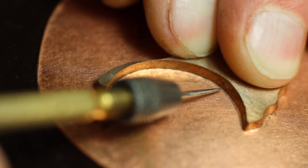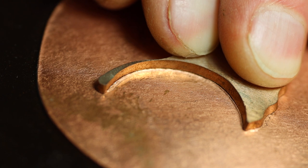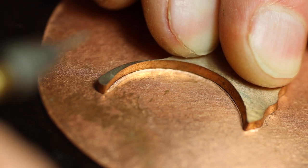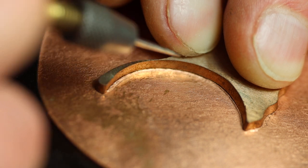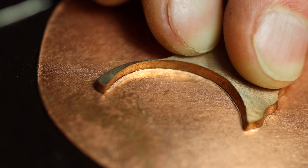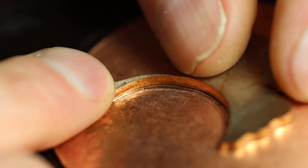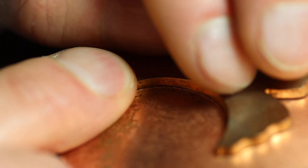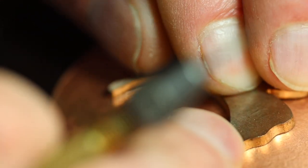Don't put yourself under so much pressure. Feel free to engrave your line a little further away from the scribe line so you've got more of a lip to push up. You can always push it down later and chisel away any excess if you need to — we'll cover that in the films that follow. So I'm going to put this in position, secure it, and then draw the next bit of the line. Up here at the top, the wavy ginkgo line — I'm going to scribe this little wavy bit.